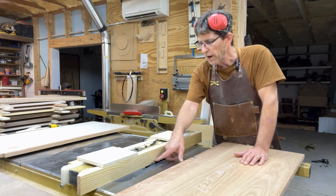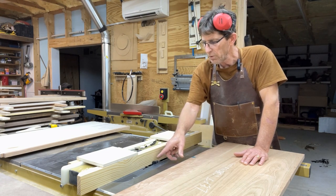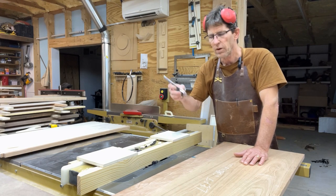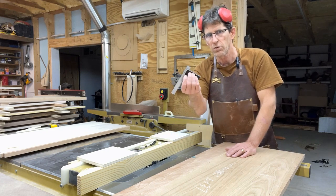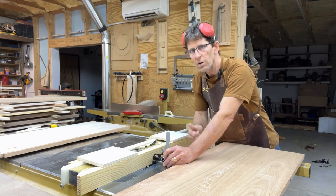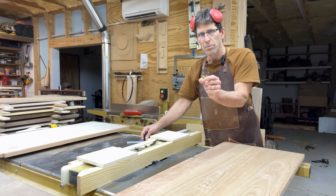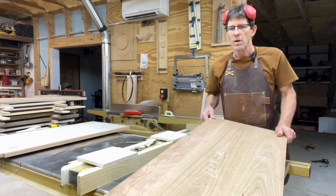All right. Using a dado stack for a 1/2 inch rabbet, which is what I'm cutting, required the 2 blades and 2 chippers. They're set. They're in place. I then took and set the elevation, the height, depth of cut, just using my square, and very carefully making sure the last movement of the motor is up. Set my blade height to 1/2 inch. So my blade's a 1/2 inch wide and a 1/2 inch tall. It's ready to cut a rabbet.